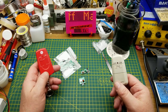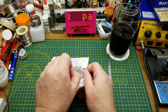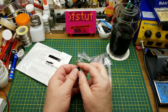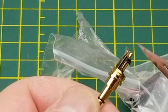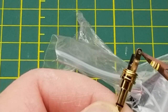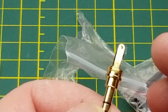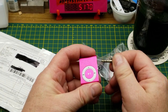That's my plan, but it'll probably be a project for next winter since I've already got everything set up for this year. Next thing is a connector — bag after bag after bag. These are some 3.5mm audio jacks, three-pole. Inside you have the tip, ring, and sleeve for a solder connection. No real strain relief so I'll have to put some heat shrink in there, but they seem like fairly solid connectors and plug in nicely to my little MP3 player.